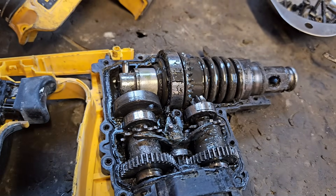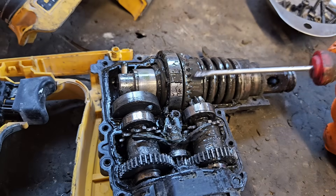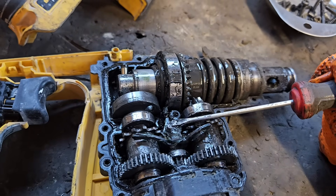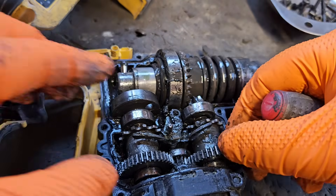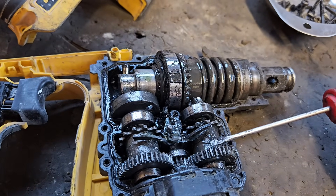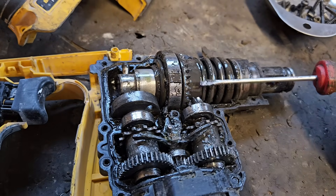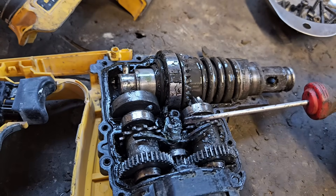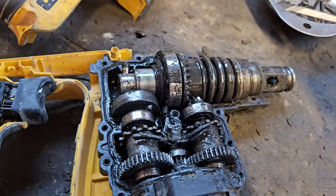So what are the things that can go wrong with the hammer? That's what we need to explore. Mostly, if she's rotating, that means this is usually okay. There's a selector there and that's activated by the selector switcher we took off in the first video. And that goes up and down to activate or deactivate either one of these. If you're going to just chisel, it deactivates the rotation. But if you're just straight drilling, it deactivates the hammer and keeps the rotation going. Or if you want both going, it can activate both rotating and hammering.